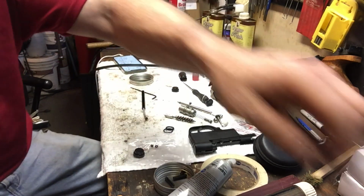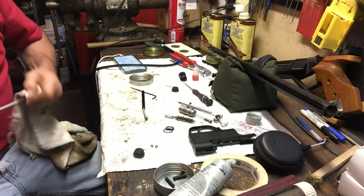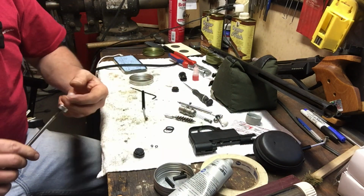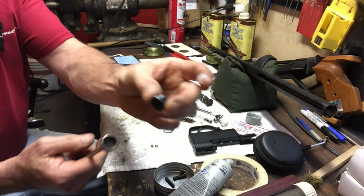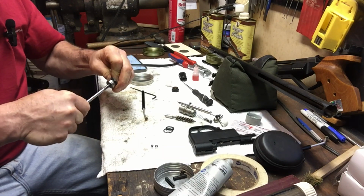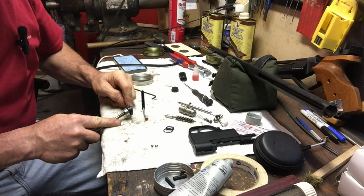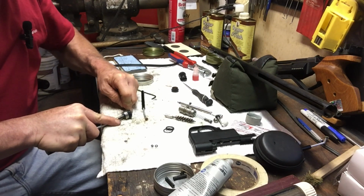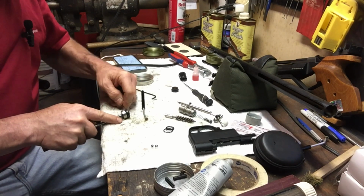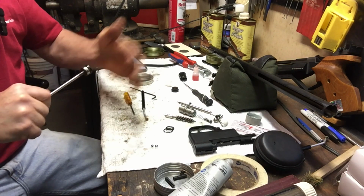Well, it kind of looks like this gun was underwater or something, at least for a little bit, and then got inside. The whole inside of the valve was full of green. That looks a lot better. So I'm going to put a little bit of grease around the inside here. Help me slide that cup in. Here's the new cup. Grease everything up. Get that. Simple as that.